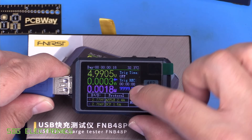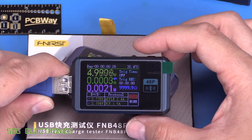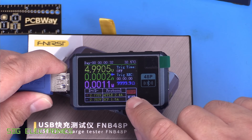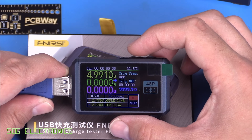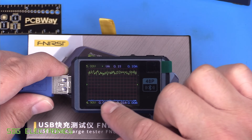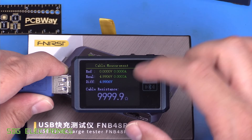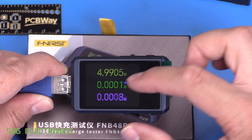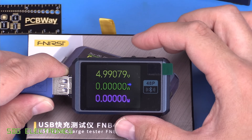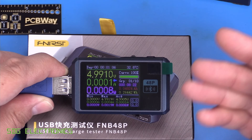You can scroll through various screens: one dedicated to showing the power delivery protocol in use, where you can listen in on what the connected device is drawing or change the mode. There's also an oscilloscope-style screen showing voltage and current waveforms, a cable impedance measurement screen, and a simple screen showing voltage, current, and power — pressing the scroll wheel gives an extra digit of resolution.